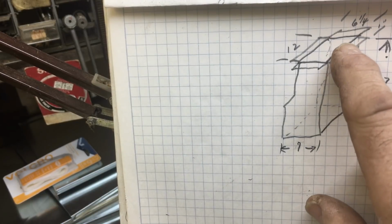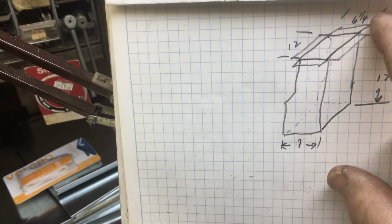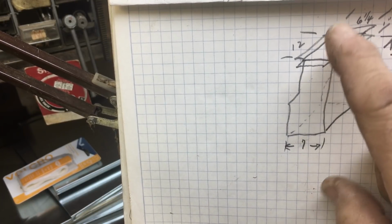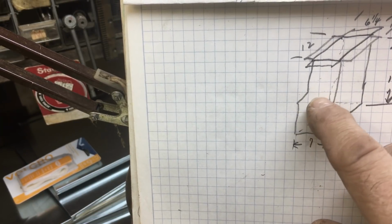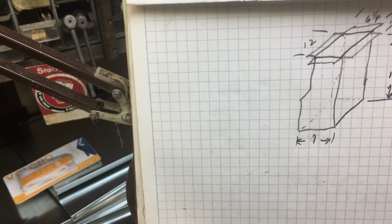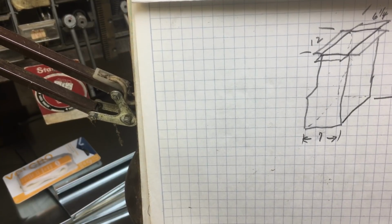But at any rate, there's essentially going to be a 6-inch opening up here where the existing 6-inch run will come in and still supply potentially this fairly unused register, yet pressurize the box and allow it to come out another 6-inch opening down here, which will supply the new register, or the third and final register, in the Four Seasons room.